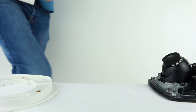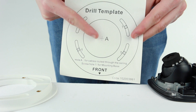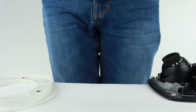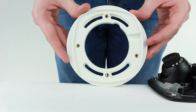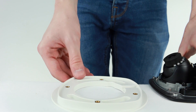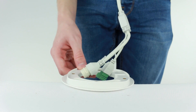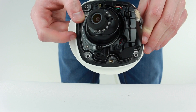When you come to mount your camera you will first have to use the drill template and drill the holes where you wish to mount. A is where you will want to drill a large hole if you are passing your cables through the wall or ceiling, and the spots marked with ones are the mounting holes. The mounting plate has four screw holes: the two directly opposite each other are for attaching the camera to the plate, and the other two are only used when mounting to a junction box or bracket. Once the plate is secured to the wall via the curved slots, pass the camera's cables through the wall or into the junction box behind the plate, then take the two small screws and screw the camera to the plate.